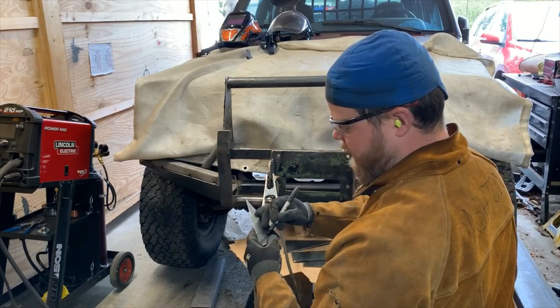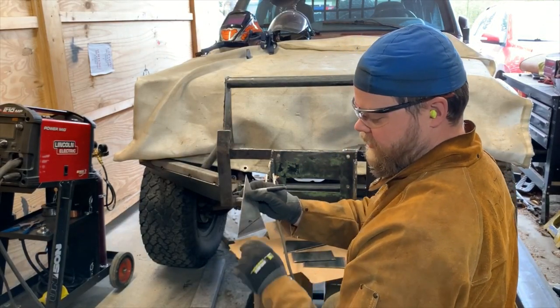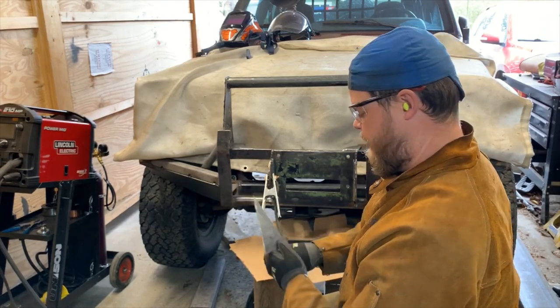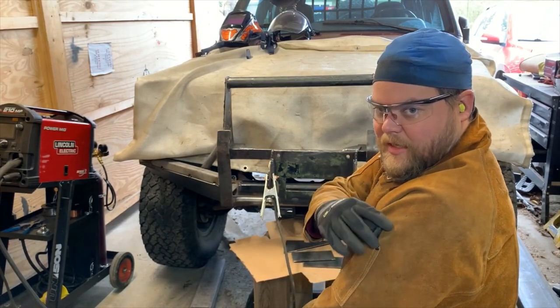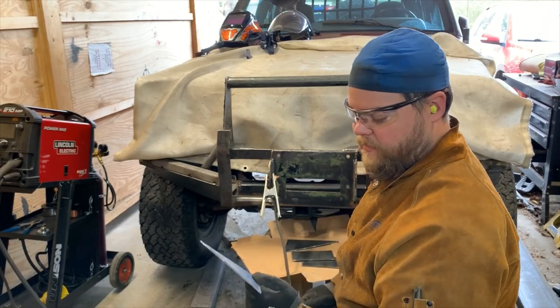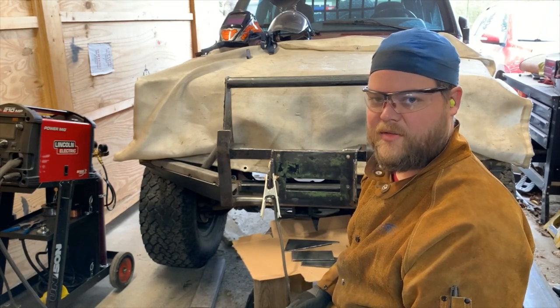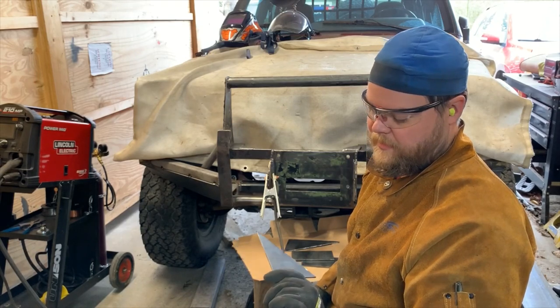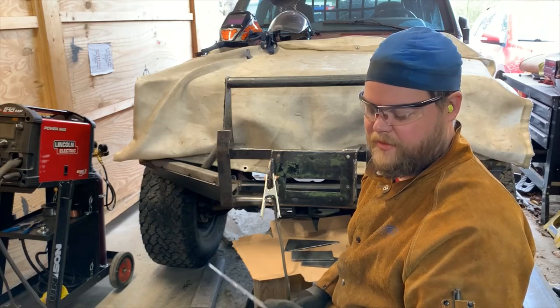So I know on both of these, I'll have to cut on the inside of that. That's the line I want to match. That inside profile, not the outside, or it's going to be too big. You can get around that by using a scribe, because that scribe line is so thin, it doesn't matter. Your fit-up's going to be perfect every time, but a scribe's not always the fastest tool, and you also are marking up the steel you're going to be using, so if you use the wrong spot, it can be pretty glaring that it's there.